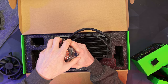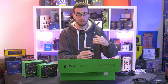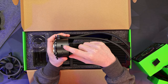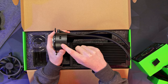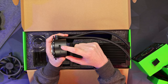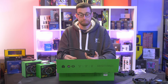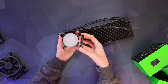The bracket can be swapped — just twist and it pops off. It comes with the Intel bracket as standard; swap it for AMD if needed. If you're mounting this with cables coming out to the right — as most AIOs do — the cables on top of the pump will connect straight out and tuck behind the motherboard tray. You've got the USB-C cable going to the USB 2 header for Razer Synapse, and the right-side connection handles pump power and daisy chain for the fans. The pump surround is plastic with a copper block for heat transfer.